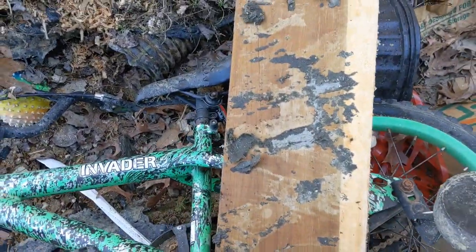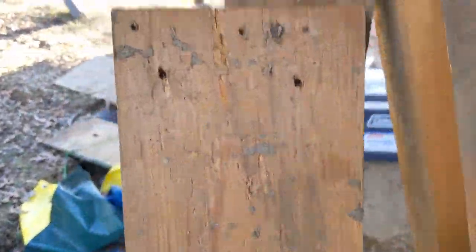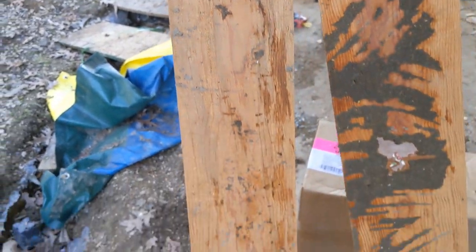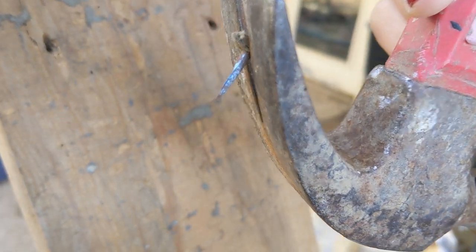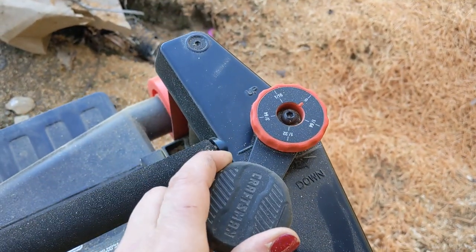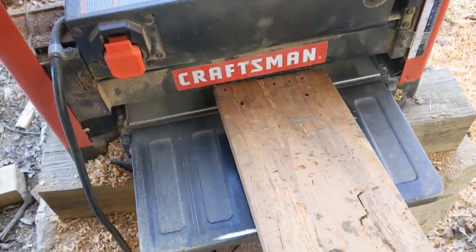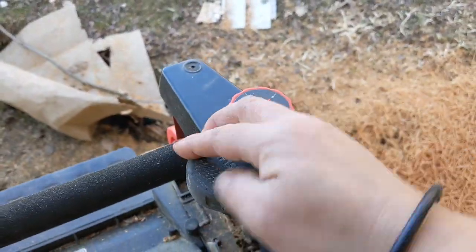Now, after I'm done with that, it's going to look like this. I'm going through and making sure there are no nails in it — here's a nail I need to get out real quick. These are little wallpaper tacks and they are all over. Let's run this through the planer and let me show you how beautiful it turns out. Here's how you raise and lower it, and I'm going to raise this just a little bit until it slides through.